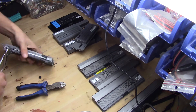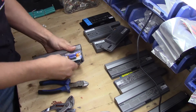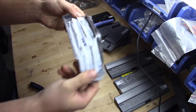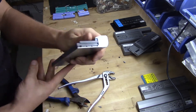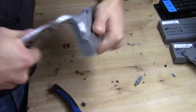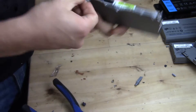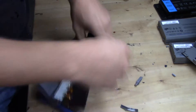Here is another view. This one went a little bit faster to open up. Once again, I throw the electronics in the electronics bin. Here you can see inside there was some tape - double sided tape, which is awful. And in this battery you can see it is a little bit narrow at one end, because it has a pouch type Li-Ion cell inside. I'm bending the edge as best I can because I do not want to touch the pouch itself, as it will not withstand the jaws of the pliers. So it is a little bit trickier to get out - you need to be careful.